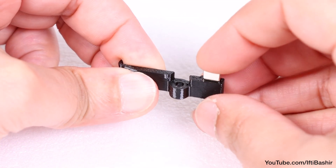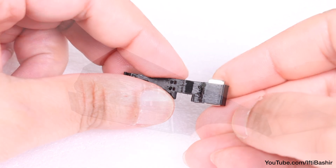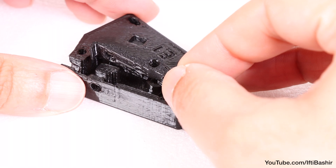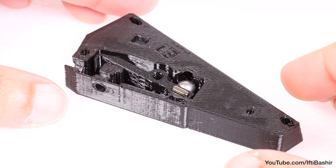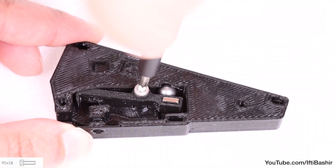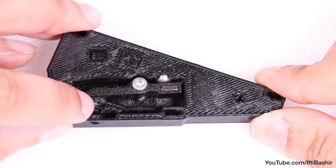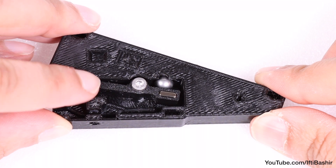Starting with the lever, insert a magnet into the dedicated opening on the end, then insert the ball into the corresponding opening inside the sensor base. Insert the lever with the magnet into the base, orientated so the magnet end is against the ball, and secure with a single M3x10 screw. This screw should hold the lever but must not be over-tightened — the lever must be able to move freely, so back off the screw if needed.